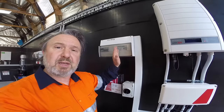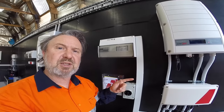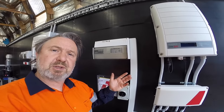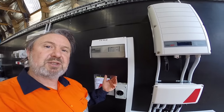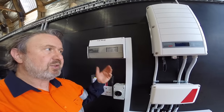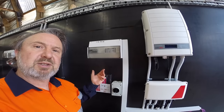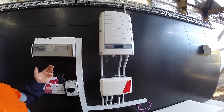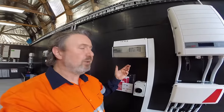It's kind of the gatekeeper — it makes sure that your solar energy or battery stored energy is primarily used in the installation. If there's surplus generation from the solar PV, it will direct it to the batteries. If there is insufficient energy from the solar PV, it will augment that with battery energy and supply the loads. And because it's running in parallel with the grid, if there's a problem, it will use the grid as the fallback. So you have the best of all three: solar PV as your primary source, battery storage as the second resort, and the grid as the energy source of last resort.